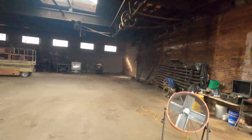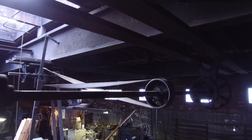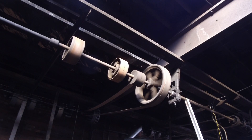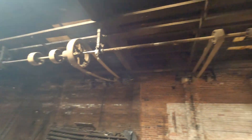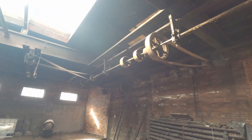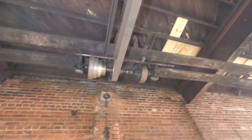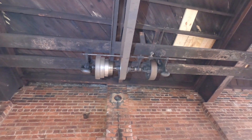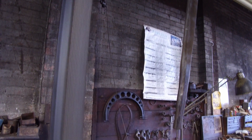Today's plan has a little bit more to do with the line shaft, which is still in this building. For those that don't know, the line shaft is how they would power old pieces of equipment. That is a hundred-year-old Westinghouse electric motor, three phase, and it turned this big drive pulley, which turned this entire shaft — so basically the whole shaft would be spinning all day. Power would come from the shaft to a pulley, and then to a jack shaft. That stepped pulley there is how you would pick the speed of the machine, with a belt running off that pulley down to a machine on the ground — four different speed options.